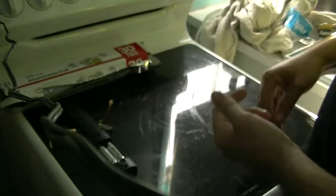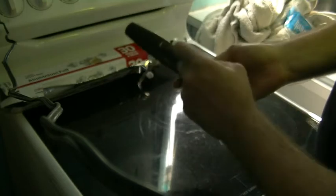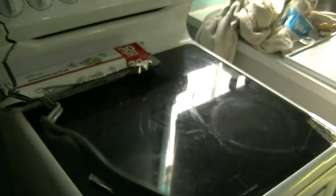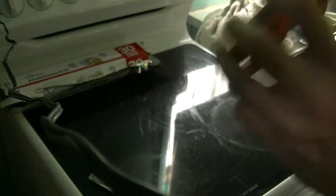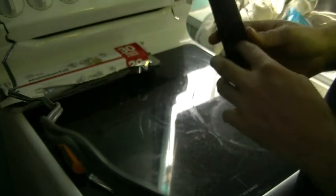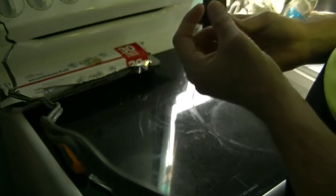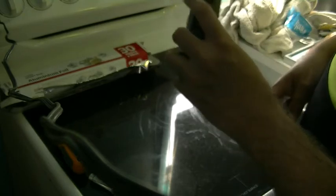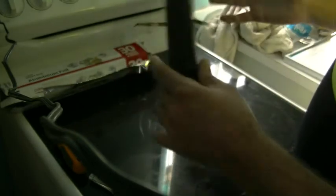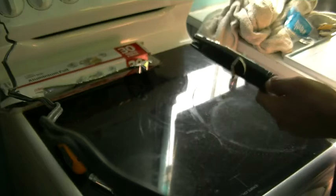Once it's done that, I'd have to basically clear it off and reset it, which is pretty much a case of just pressing the button. Now before I start, make sure your batteries are out and that it's discharged. You can do that by using a screwdriver — if this was intact, you'd run the screwdriver just into it to short it out. What I've done on this one is I've already disabled the auto discharge, which is a small resistor that lives directly underneath the capacitor that gets charged up, so that you don't have to continually hold the button for it to charge. Otherwise, you'd press it to charge it up and let it discharge within about two or three seconds, which is a bit pointless. They do it for safety, but we don't want safety here — we want death.